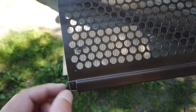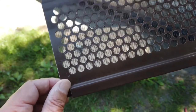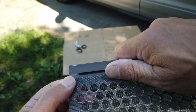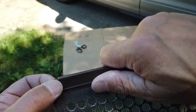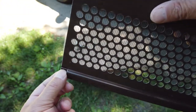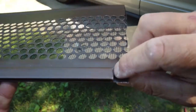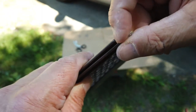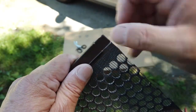The remnant of the upper part of this lip is now cut off and cut flush — smooth so that this tab is smooth. Same thing on the back side: I've cut this rib off clean. This is the piece that actually goes into the window frame on the driver's door side. Same thing with the other end — cut the lip off, trimmed it flush. And the same with the inner edge — I could notch that one a little cleaner, and I think I will. Same thing with the back edge — now flush.